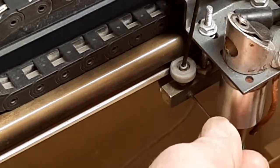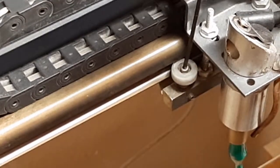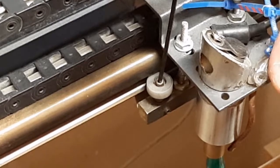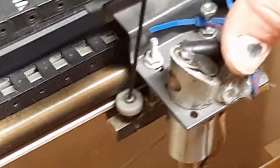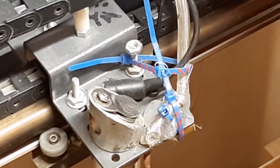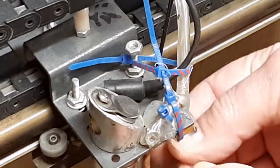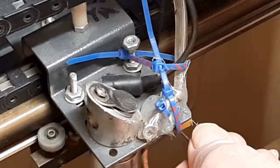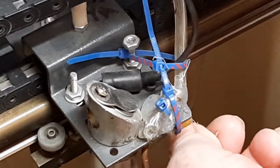I thought I would show you what this effect has here, because now this carriage is tight. It still moves, still slides, but you want to make sure that the screws on these wheels are tight before you start messing with that screw down there, so that you've got something to actually turn the wheel against.